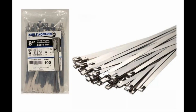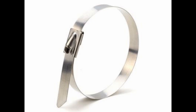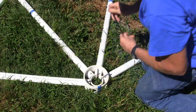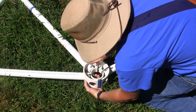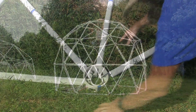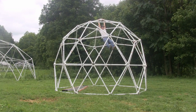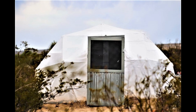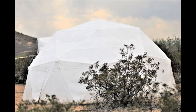You can also build the larger shelter domes that are held together with 350 pound stainless steel zip ties, making the hub design strong enough for commercial construction purposes. These shelter domes can be covered in mesh and coated with latex cement for building a permanent concrete dome for living purposes.